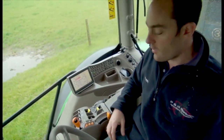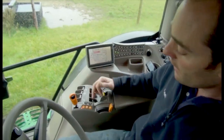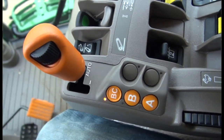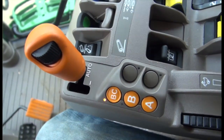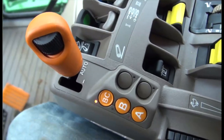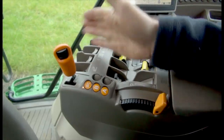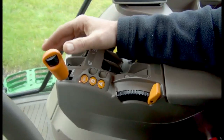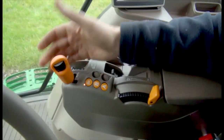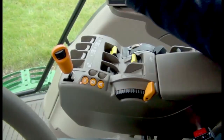We've got the new direct drive transmission which is nice and simple to operate — in fact it couldn't be simpler. You've got three buttons here to select your ranges: A, B, and BC range, which works right up through all eight B power shifts and all eight C power shifts. Most of the time you keep the stick in auto, although you can flick it across and work it like a standard power shift or triptronic gearbox. The thumb wheel on top sets your target speed — the speed that the auto functions will drive up to. Dead easy.